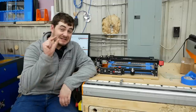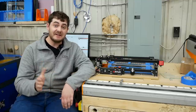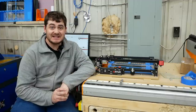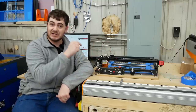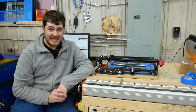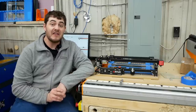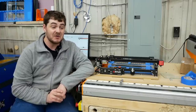I've got a little bit of an issue here. My diode laser engraves the glass perfectly fine and the results are lovely, but it's slow — much slower than I was expecting. I did a test batch with six plaques on the bed and engraving those six plaques with my logo and some test names took six hours — one hour per plaque. With as many plaques as I have to do, if I were to engrave a solid 12 hours a day, it would take about 35 days to engrave all the plaques, which is obviously not an option.